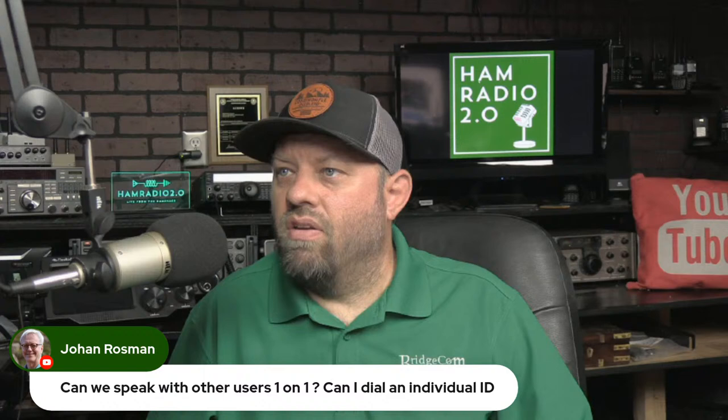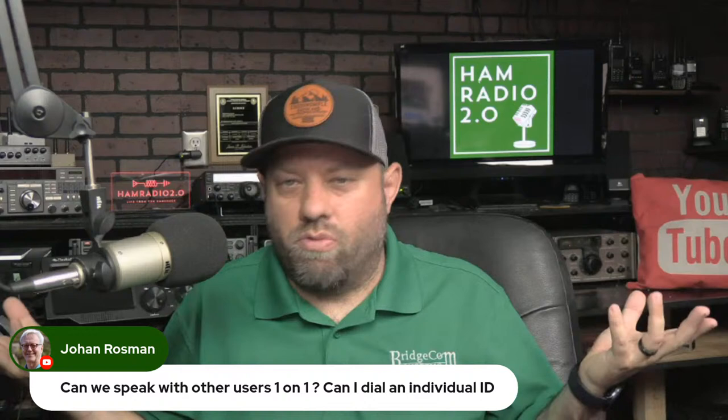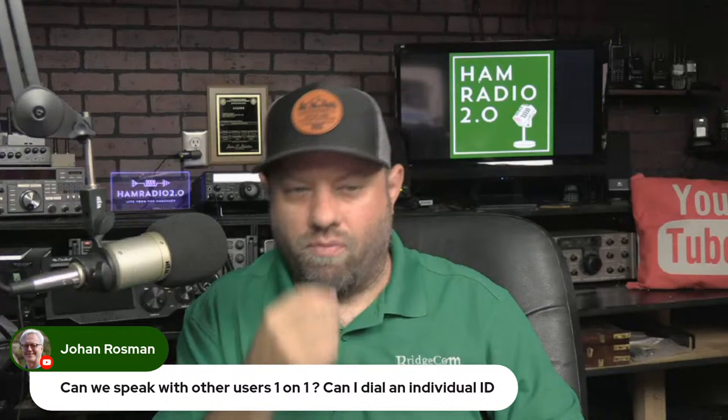Can we speak to other users one-on-one? Can I dial in an individual ID? Yes, you can. You create a channel, and instead of putting the talk group ID, like talk group number 3148, you put their ID in that channel and just name that channel Jason, KC5HWB, and then you put my ID in that channel for the talk group number. And then they do the same thing for you, and then you can talk back and forth to one another.